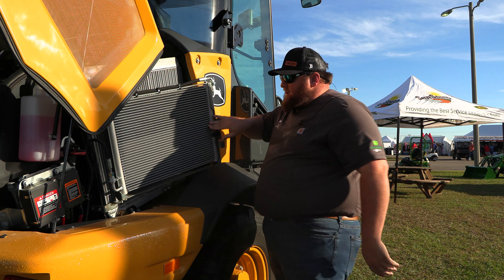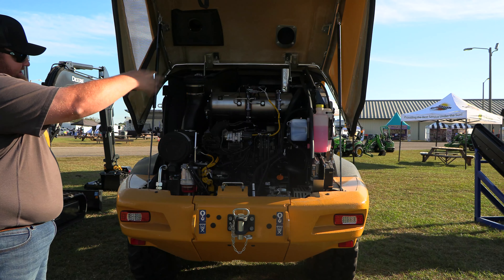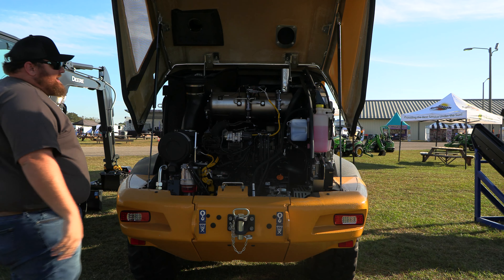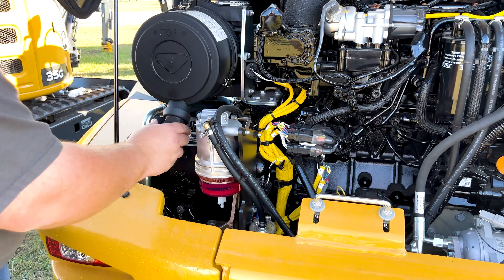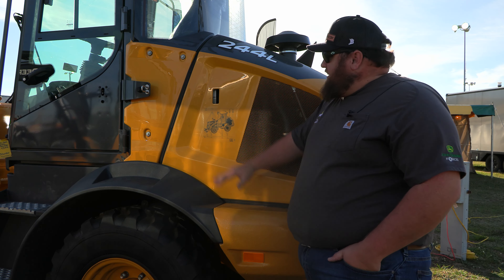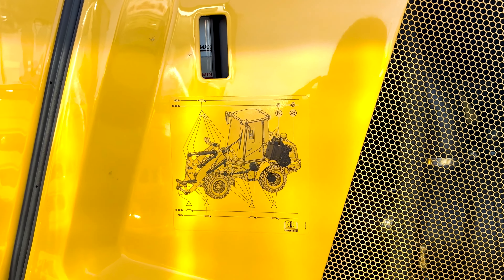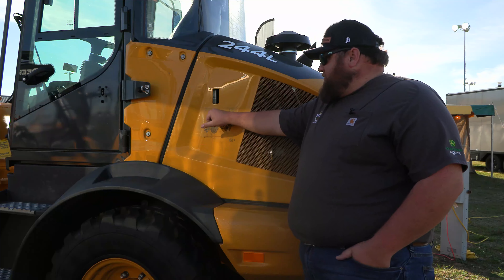On the backside of the 244L, the hood latches up clear so you can check everything — all your vital areas for daily inspection routines. If you're out in the field in dry dusty environments, you can swing out this fan, get a good air compressor in there, blow it out, get all the dust out, make sure it's clean so your machine is breathing well. Moving around from there you've got the swing-out cooler so you can dust it out — everything back here is easy access. Easy to get to: fuel, water separator, filters, and the dust unloader valve. In dry dusty environments doing a lot of dirt work and pad preps, it's important to let your machine breathe so it runs longer with a longer lifespan.